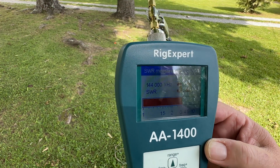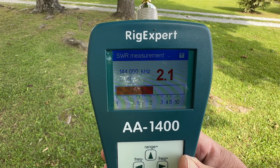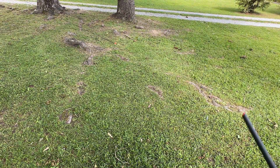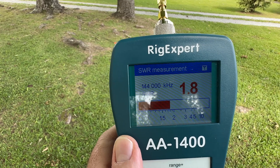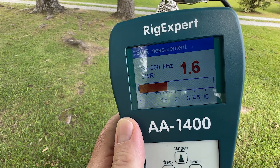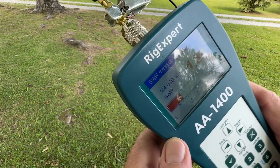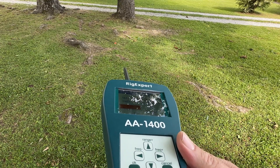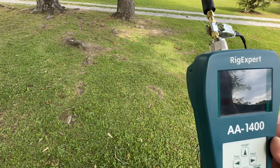Let's try a different antenna. With the 6X2 antenna we've got a better SWR than with the Signal Stick — 2.1 at 2 meters, so that's not bad at all. Let's see what happens when we put our counterpoise on that. Apparently it likes my left hand — that dropped our SWR down. Adding the counterpoise helped a little bit on this antenna — very little. 1.8 down to 1.6. If we go flat, 1.9. So that doesn't help a tremendous amount.